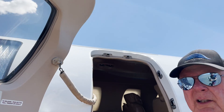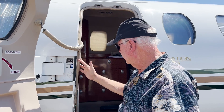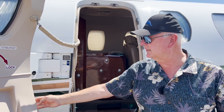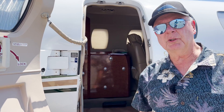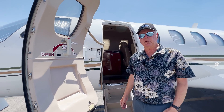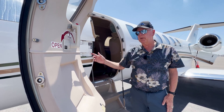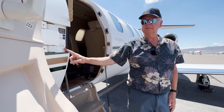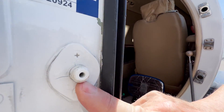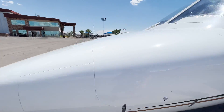In the door, we've got it in the stowed position. These grommets, if they're rotted, are really inexpensive to replace and easy to get from Textron. So now we've gone over the door, how it seals, and how the service air works to inflate this door seal. Now what we're going to do is have Tigre start the right engine — it doesn't have to be much, just long enough to build up a little bleed air — and then we'll activate this button. If we have any water, it will come out of this port.